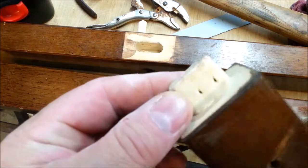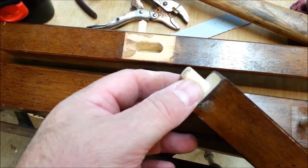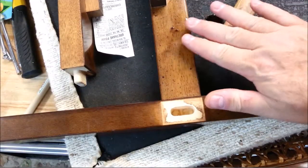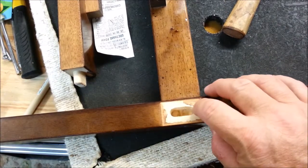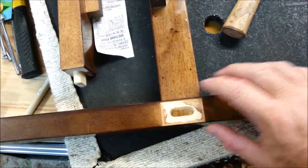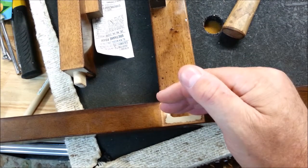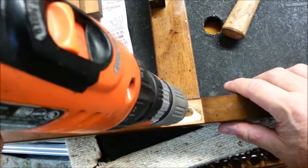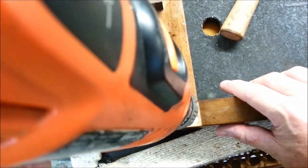I just think it was really poorly put together. I'm using an acid brush and painting all the surfaces with Titebond — we'll get to that during reassembly. I couldn't separate this rail without possibly breaking some wood, so I'm going to drill into where those dowel pins are. Then when I put the tenon in, it will push glue in and around the dowel pins. I've already done another one, so I know right where they're at.